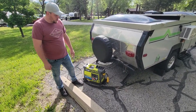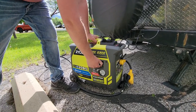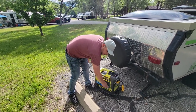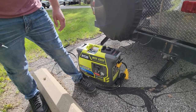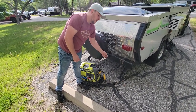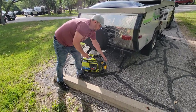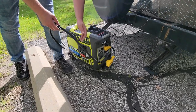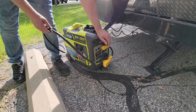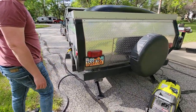If you've decided to rent our inverter, we've got this Ryobi unit — 1,800 watts running power, super easy to start. Move it to a cold start position and pull three to five times. Please make sure that if you're ever using this unit it is tethered to something. The small black key is what locks this unit up — it's not an inexpensive unit, so make sure it comes home. We've got the 30-amp cable that goes to a 15-amp adapter. You can also plug in devices like your cell phone using USB without the risk of damaging your devices. This unit also comes equipped with a backup camera — plug it into the cigarette lighter and it will power on when you put the car in reverse.